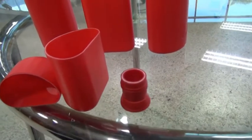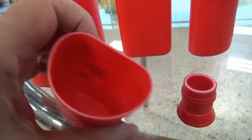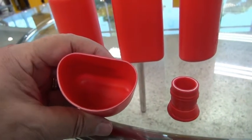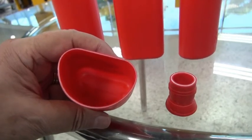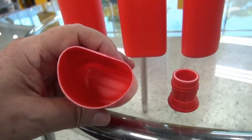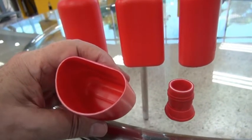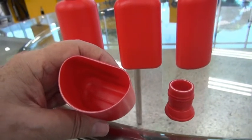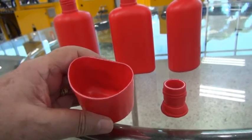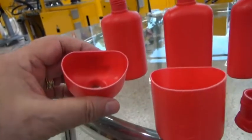Also here you see the bottle we have cut open. You can see the white layer, I hope, in between the red layers, and they are really very even. And this is very important in co-extrusion, that you have a good layer distribution in order to improve the quality of the bottle. And here's another cut we made on the same thing.